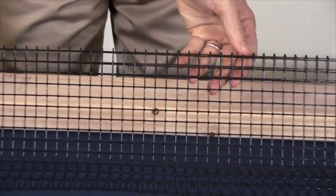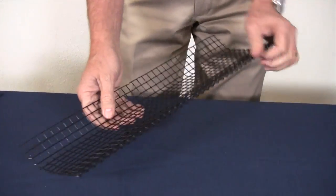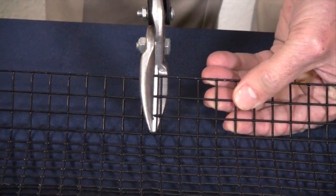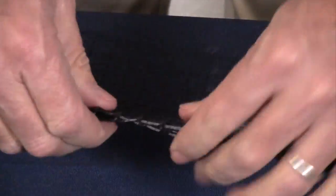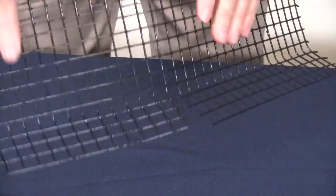Since we are working on a single solar panel here, we will be using smaller pieces to demonstrate how to connect the mesh panels together. We recommend starting at a corner. Cut a length of mesh about two feet long, bend up the bottom as shown earlier, fold the top over at the correct height if necessary, then cut the lower flange and bend the entire piece 90 degrees.